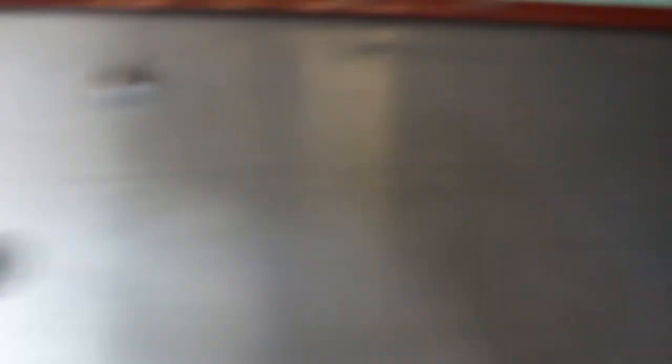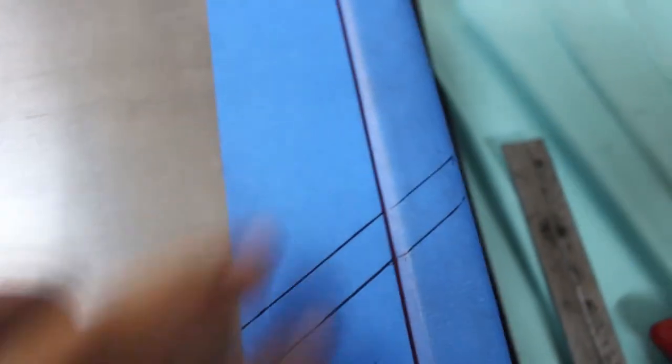After you've made the lines, you can see here they're lined up. If you put this door panel in and it shifted up or down, you can obviously see it's not lined up, so you move it back to where those lines are straight with each other, and then you can continue marking and drilling.